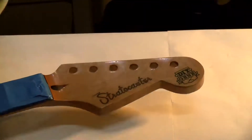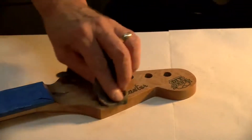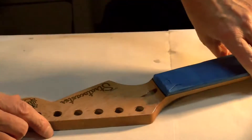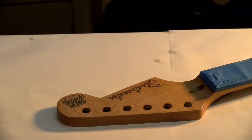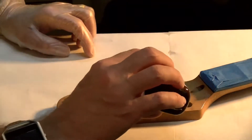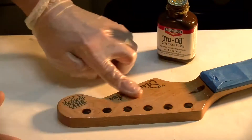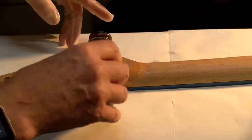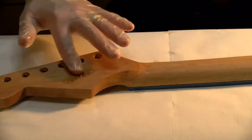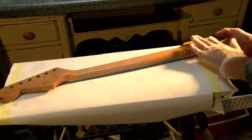Also on this guitar, I built some logos I want to use for the headstock. You could use the original Fender logos; I created new logos using slide decals, and I'll do a video on how to recreate your own slide decals. I'm amazed how far true oil goes — one bottle did the finish on the neck and the entire guitar with multiple coats. Depending on the time of year and temperature, you can sometimes re-coat true oil in as little as two hours. I generally try to let things dry up to 24 hours so they really have a chance to cure out.